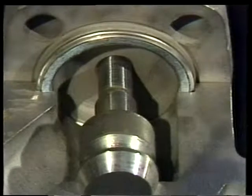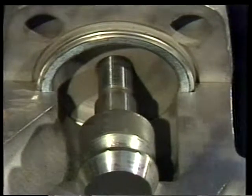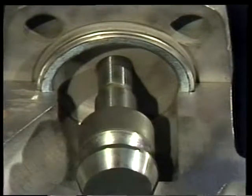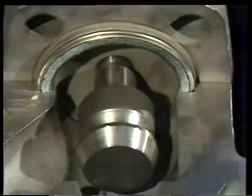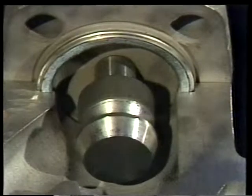If the leakage doesn't stop after the packing has been adjusted, the valve will have to be repacked by removing and replacing the old packing. Many manufacturers advertise that their valves can be repacked while still in service. The valves they're talking about are special globe valves that are made with a back seat, that is, with a seating area on the stem above the top of the disc. When the valve is fully open, the back seat is seated against the top of the bonnet.